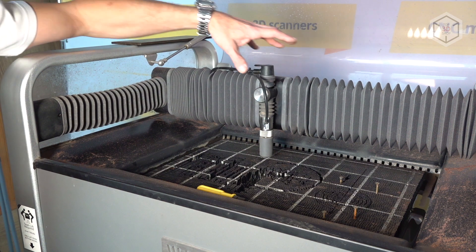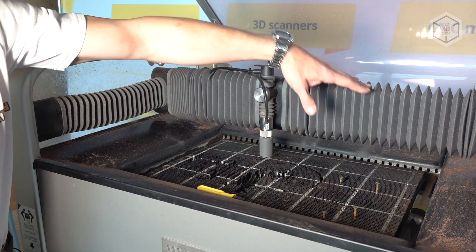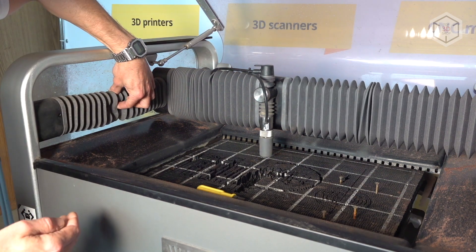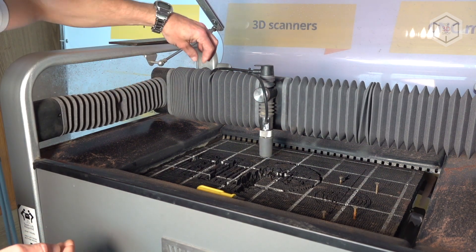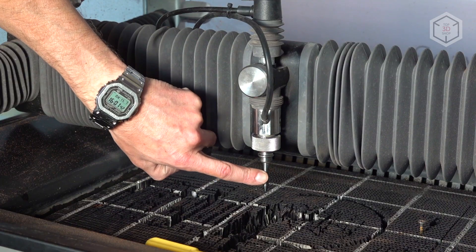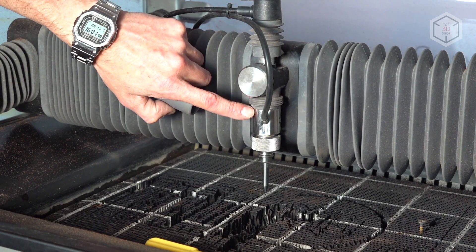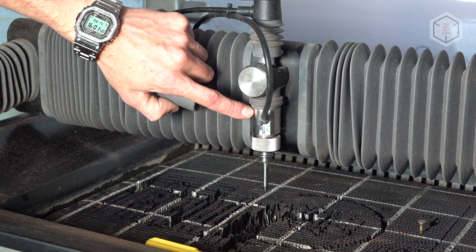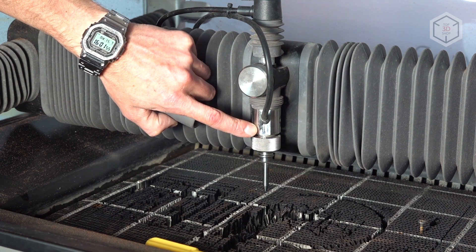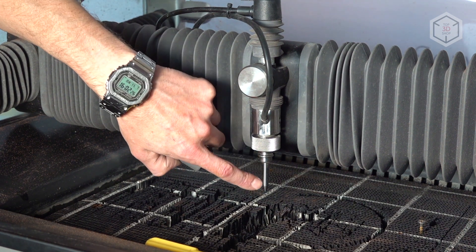Since it's impossible to completely protect the working area from abrasive splashes, the machine's guide rods are closed off with rubber sealing. The y-axis is based on a single rod guide, with dual rod guides on the x-axis. Removing the rubber cup clearly reveals the second nozzle. The upper nozzle forms a high-pressure jet of water, but after passing through the mixing chamber it gets distorted, so the second nozzle is needed to focus the abrasive water jet stream.